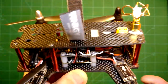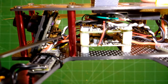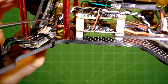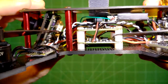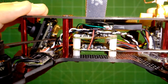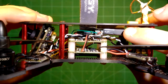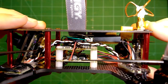Then let's move on to the PDP, which you can see here on the bottom. So let's just try to bring this into focus. Yeah, the PDP here on the bottom is the Matek PDP, which I will also link in the description. As you can see, I haven't used any connectors. Everything here is directly soldered, which is to save weight, of course. On top of the PDP, you can see the NAZE. I got one of the regular Naze revision 5 controllers for this because they were very cheaply available on HobbyKing a few weeks ago. So this is really nice. And on top of that, you can see my FrSky receiver, the D4R-II, which we all like to use.